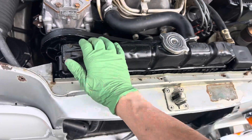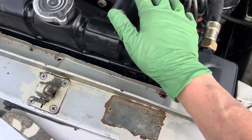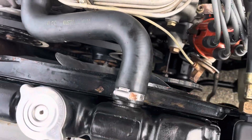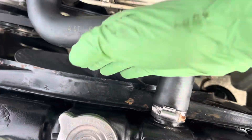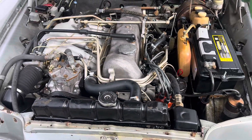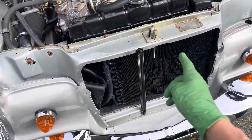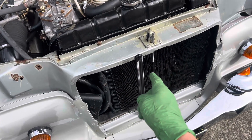This one I was going to do a few weeks ago, but then they discovered there was a radiator leak, so they did a radiator replacement. The only problem was they went through all the trouble to take off the fan, the radiator, and do everything — but they reused the old thermal fan clutch. I slipped my camera down inside to confirm it was the original old fan clutch. This has 121,000 miles and it's a 1969 or 1970. You should change the fan clutch, especially without an electric fan backup and with this really poor condenser.